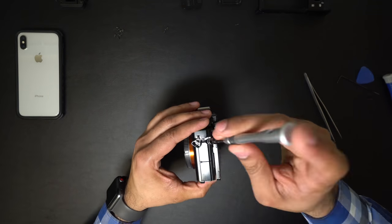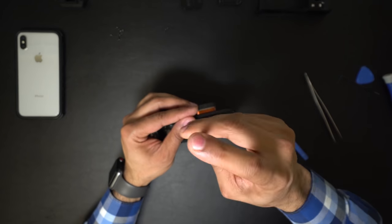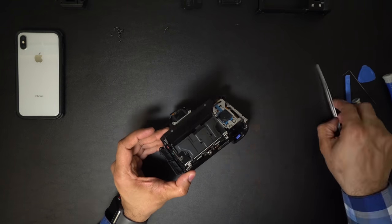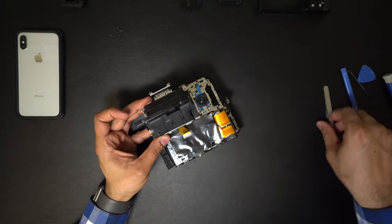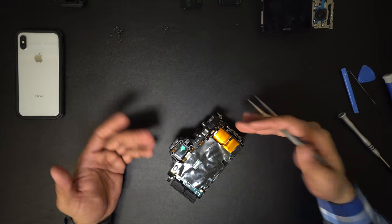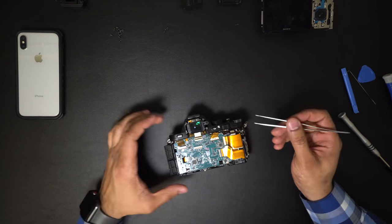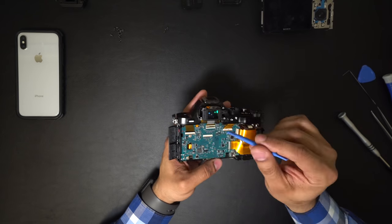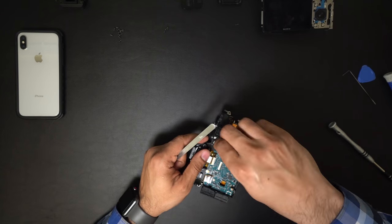After that, unlink the flex cable from the front panel and remove the 3 screws that are holding the LCD, 2 screws on the bottom and 1 screw on the side. Lift the LCD and remove the LCD flex cable. An installation tip: it was sticky, so take it gently and remove the flex cable. I use the tweezers as I am comfortable with them.